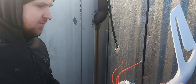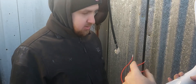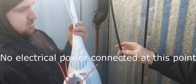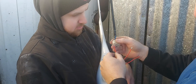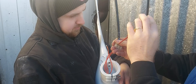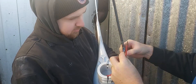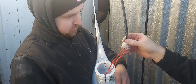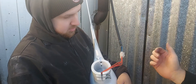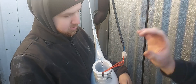We've got the new turbine now — the lad is going to hold that for me while I do the connections. We've got it on loose with all the bolts greased up, so we'll get her wired up and clamped, then fit the hub with the blades on. Remember, it doesn't matter which way around these go. That's the connection done — all the wiring is staying inside the tube, and because it goes over the top it keeps everything out of the weather. There's not even any signs of rust from the old setup, so we're happy with that. Going to slide it on now and get her clamped up.